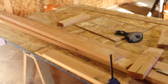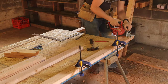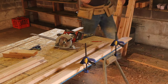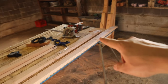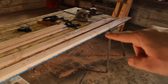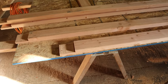All the half laps are done. One thing I forgot to mention: the length of each board is exactly the dimensions you measured for the door opening minus whatever tolerance you're using. For me that was 90 inches tall by 66 inches wide per door, so I cut each board to 90 inches long and 66 inches long. The half lap joint doesn't lose any length — it just overlaps exactly end to end.